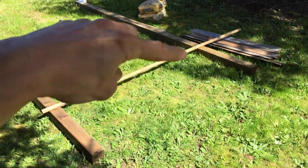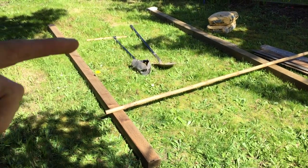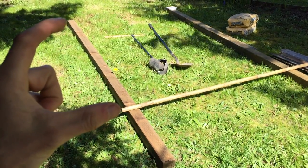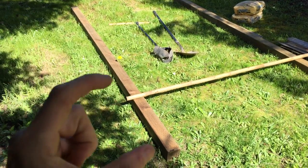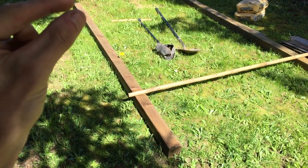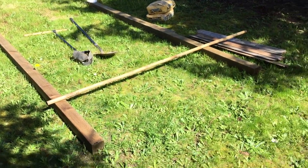Basically all I'm going to do is measure how far apart I want the posts, then dig two holes in the ground nice and deep. You have to measure the height of the bar — let's say you want it to be seven feet high where the bar is, so you're going to keep seven feet out of the ground, bury three feet in the ground, and account for a couple inches at the top where the hole is going to go to keep the bar across. Let's just start building it.